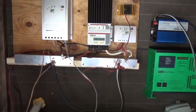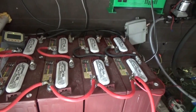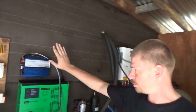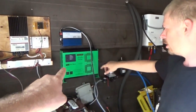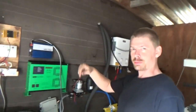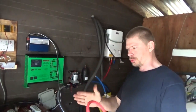The battery bank is now very nice and neat — there's nothing visible on top. He's also put out a pure sine wave inverter that Phillip brought me. Its idle consumption is only 1.06 amps at 12 volts — that's crazy. My current inverter uses 200 watts idle, which means I have to turn it off at 9 o'clock every night, because if I don't, just the inverter alone will run my batteries down to 50%.